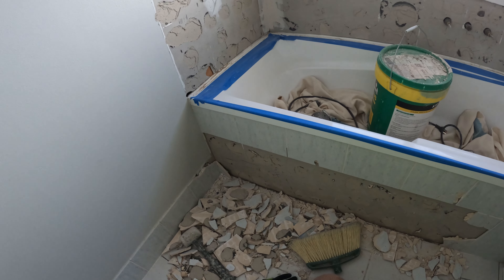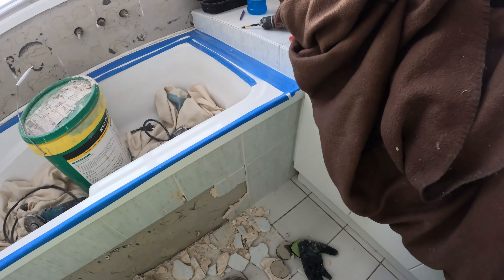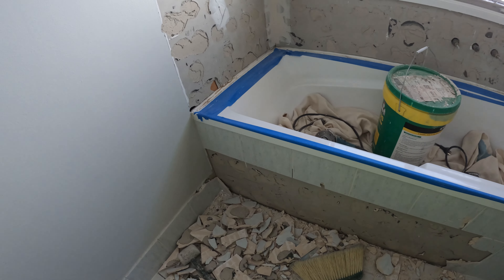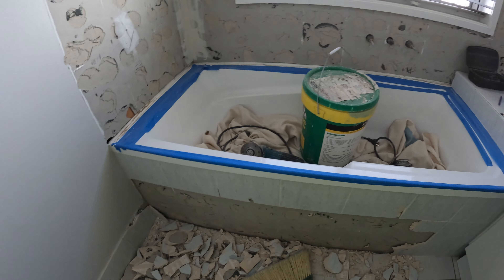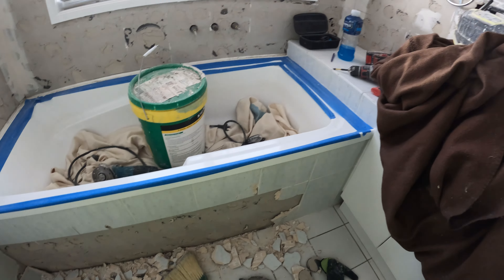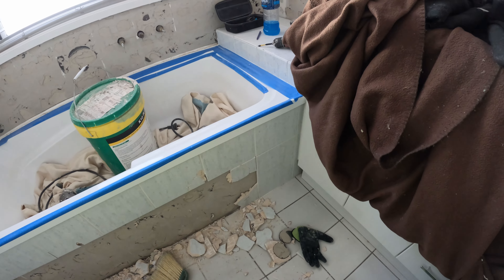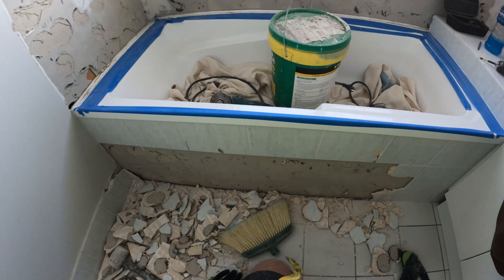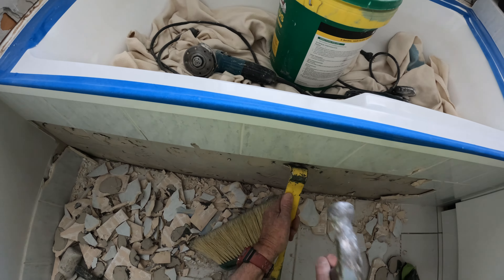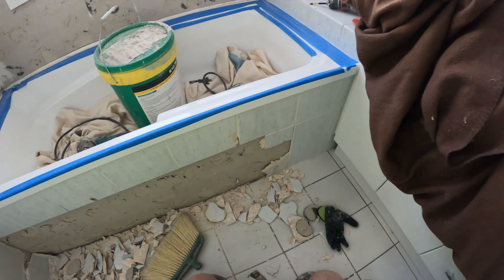This was good glue in its time, but it was so expensive. Back in the day when I employed a lot of tilers, you'd rock up on the job and they'd be having a glue fight — such a waste. The two-part rubber was so expensive back then. Now it's all cement-based, modified with polymers, so it's not so expensive. You're paying between $20 and $35 a bag for good glue — it's a lot different to the two-part rubber.